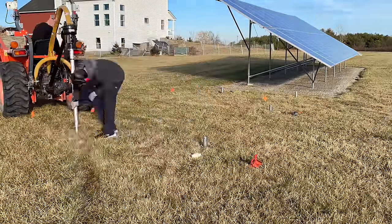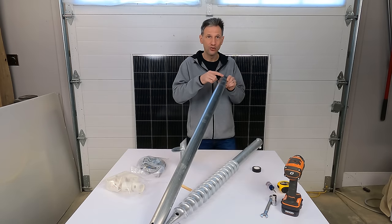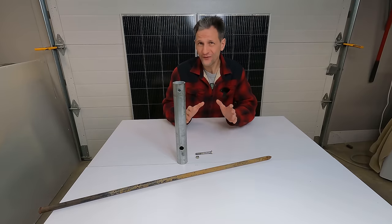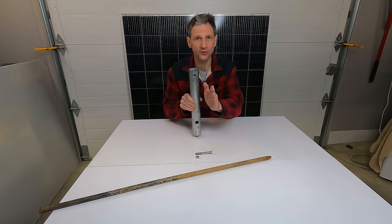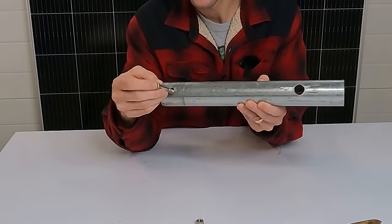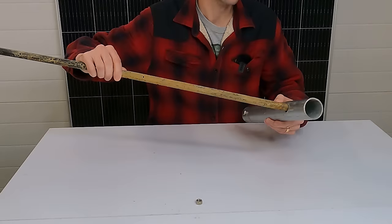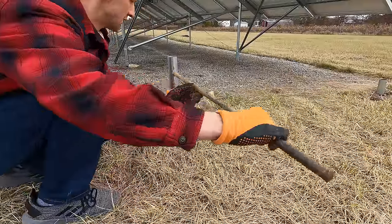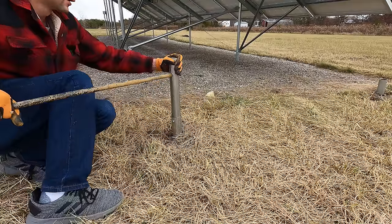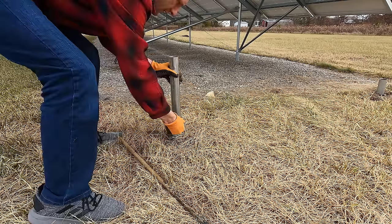You may find it easier to set the corner post first and then fill in the middle. Pro tip: make sure that the final position of the screw has the bolt hole facing east-west, or the bolt for the brace won't line up. If you're having trouble getting your bolt holes perfectly aligned with your array, you can simply take a piece of scrap pipe and drill two holes in it — one hole for the bolt that's going to drive the pipe, using your 5/8-inch bolt, and then a larger hole for a landscape stake. That works as a nice large wrench. You can back the post out or turn it a little bit deeper to raise or lower it, or just use it to tweak the angle and get your screws lined up.